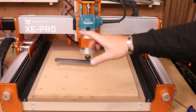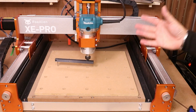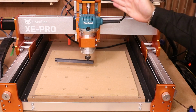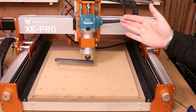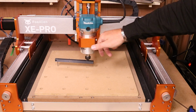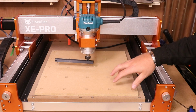So to get to the bolts on that side, I literally had to stand in front of the camera, so you would have just seen my back. Basically, what I did, slacken the 4 bolts off on this side, slacken the 4 bolts off on that side, and it just allows enough play to adjust it. And when I say slacken off, I'm only talking quarter, half a turn, and you should just start to get enough movement in this to counteract it. Now, I just kept spinning this around and adjusting that until it sounded even all the way around.